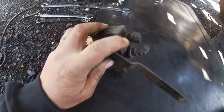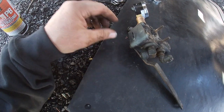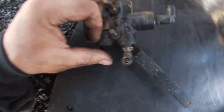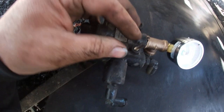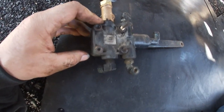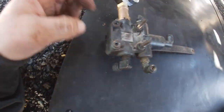Let me take this off and get ready to plumb the new one. You can see the exhaust port — it just blows the air out of there. A lot of times they have a little pigtail on them, a little section of hose; it's not really necessary but we'll probably put that on the new one. You can see where it says C2 and C1, and you can read where it says 'dump' — you put air to here and it pushes a plunger in here to bypass. What I think is happening is this is bypassing even when it's in the level position — I'm getting air exhausting out of here just a little. So I think this valve is no good.